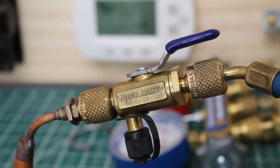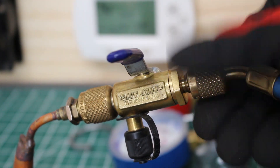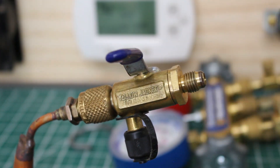Once you're done with your task — let's say you were recovering or pulling a vacuum — just make sure to close this, and then remove your gauges. Typically for me, I don't really do this process when I'm recovering or charging, as it's not such a big deal on smaller systems. But when you work on larger systems, this is definitely going to come in handy. Typically, I only use this when I find a leaking Schrader valve and I want to replace it without having to recover, which is absolutely amazing.